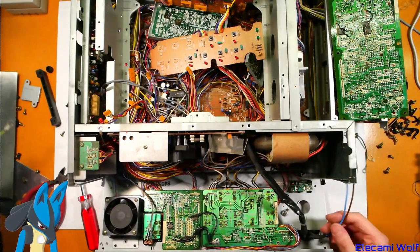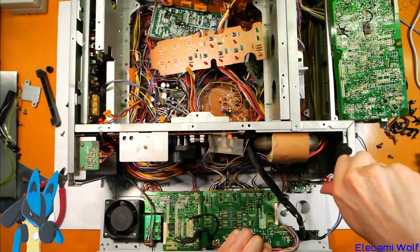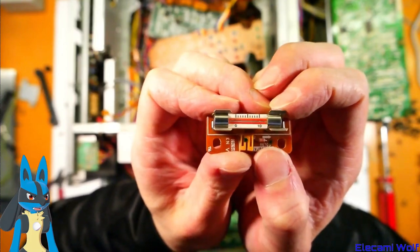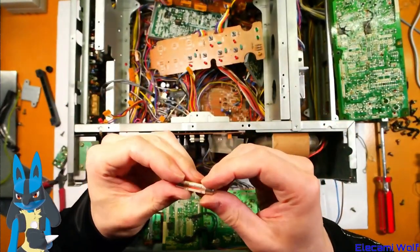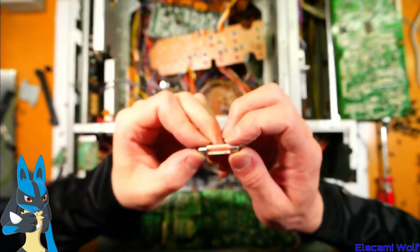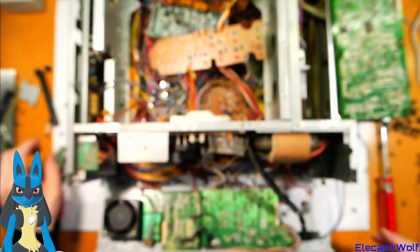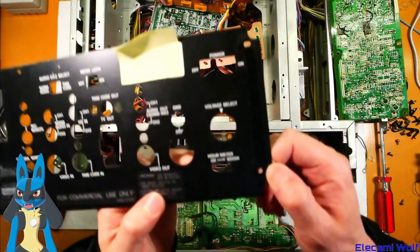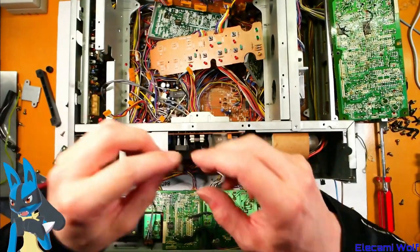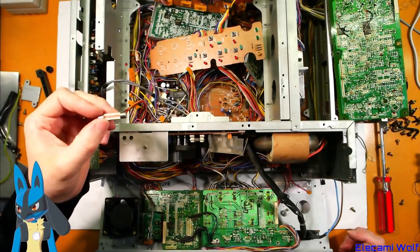They've done it right into the switch, so that's not too bad — I thought there was going to be some really dodgy join under there, but it's fine. Now the hour meter: it's just something that looks like a fuse, the same form factor as a fuse. It might be mercury, or some other kind of metal where a bubble moves across it. Zero to ten, but it's always times a hundred I think — it says it's zero to five thousand hours, and after that you'd have to get a new one. That's the hour meter: an interesting little thing found in a lot of professional equipment, just to count how long it's been powered on.